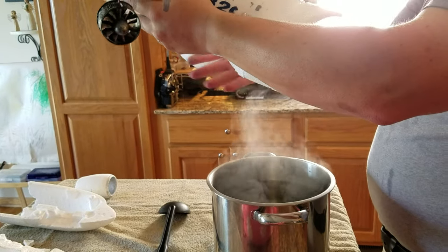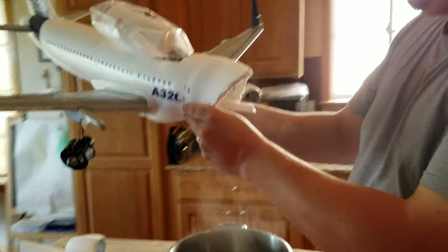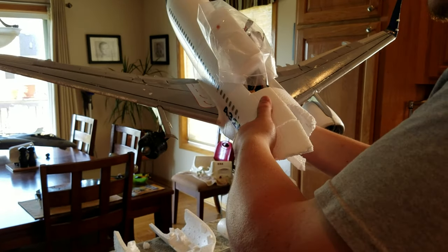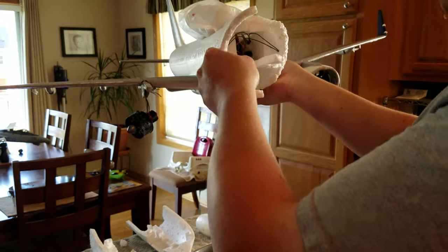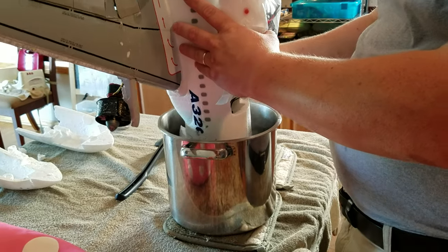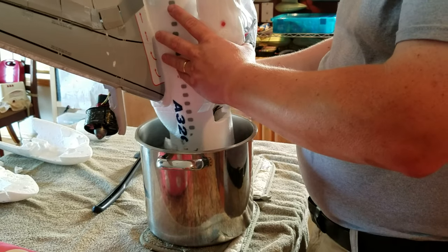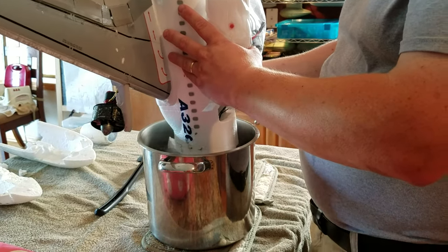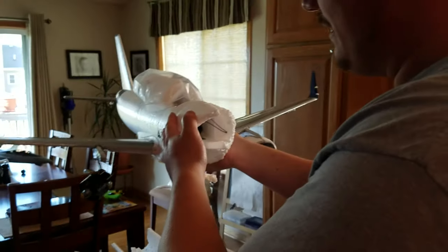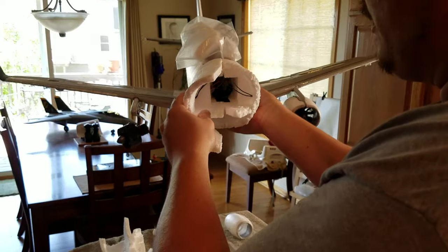See, now it's relaxed a lot. The only problem is this stuff has relaxed maybe a bit more than I would like it to be, but it's not an exact science. You just kind of get the parts lined up where they need to be. I'm just giving it a little rock to get the water up a little bit higher on the side of the aircraft. Now this is going to dimple like crazy — there's just no getting around that. You can squish the dimples back down; you can't bend it back when it's that far out of whack, not unless you heat it first. Be careful — water does get trapped in there sometimes and it'll squish out on your hands and burn you.